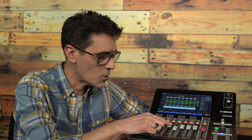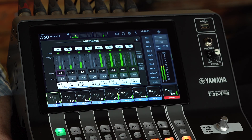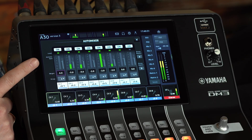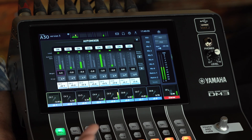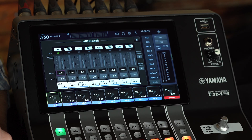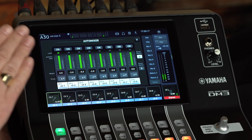Increase the weight of the channels you wish to be more prominent. Of course, if a person speaks quietly you can push up their fader as normal, or pull the fader down a little for a loud person, and allow the auto-mixer to take care of the rest. Keep an eye on the auto-mix gain meters to understand how it's working — only one channel at a time has the full gain. When two or more channels have active inputs, they share a portion of the gain. And when nobody is talking, all the gains are reduced a lot. Yet as soon as someone speaks again, the gain shoots up, ensuring nothing is missed. When you bypass the group, all the gains will return to full level, so be careful — it brings you back into full manual mixing mode.